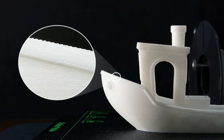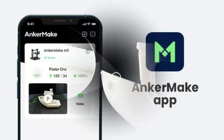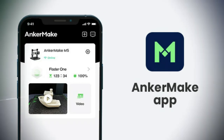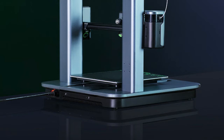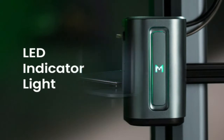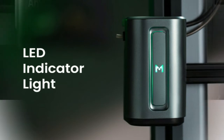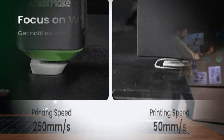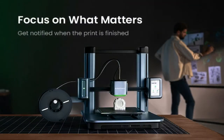Extrusion — the foundation of fast printing — starts with the improved multi-stage gear system, with a 9.37 reduction ratio putting out 0.8 Nm of force. The strong winding pressure on the melting chamber makes extrusion quicker. The 60-watt heating bar rapidly raises the nozzle temperature to 392°F (200°C) with 1.5 times the efficiency of other printers, ensuring the filament easily releases while printing fast at 250mm per second.